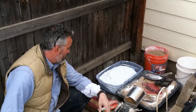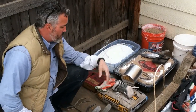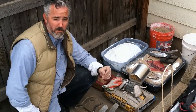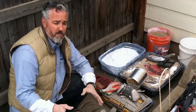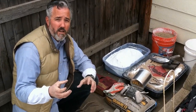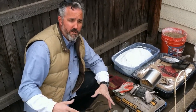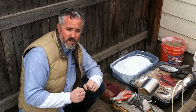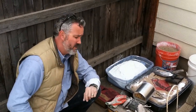So we're going to use a bigger aggregate on this. I'm actually going to use all-purpose sand, which has bigger pebbles in it than play sand. If you go to the hardware store, you'll see play sand and all-purpose sand — all-purpose has bigger grit sand in it. I'll take out a portion of that sand and add in a portion of even bigger aggregate sand, mix it into the whole mix so it'll come out with big pebbles in it when I'm finished.